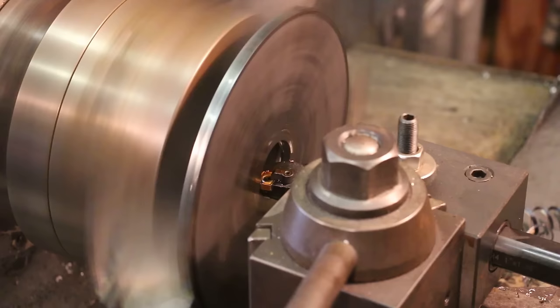So I finished machining all six of the blanks. Came out fine here. I will say that as we went through these, I was able to slowly play with the settings on the lathe, not wanting to push it with that glue chuck where we would break the seal, but at the same time trying to get my speeds and feeds up as fast as I could to get the job done. I was able to get the lathe running a good bit faster and without any problems. And after the first couple, it was taking me about 45 minutes really start to finish to finish these things out.